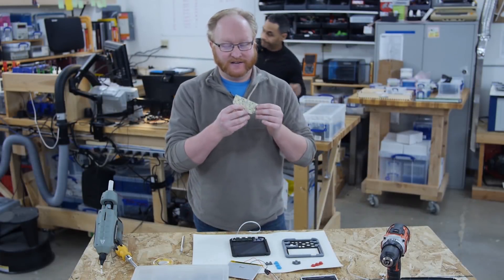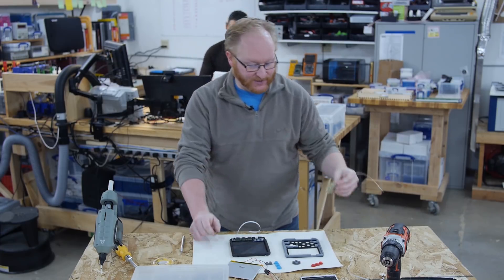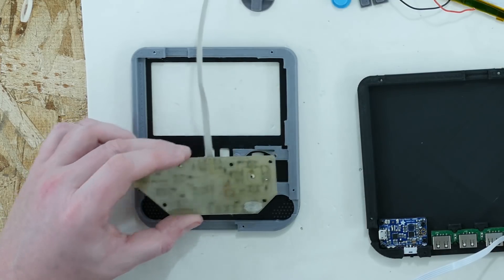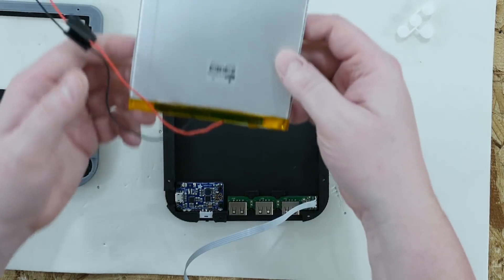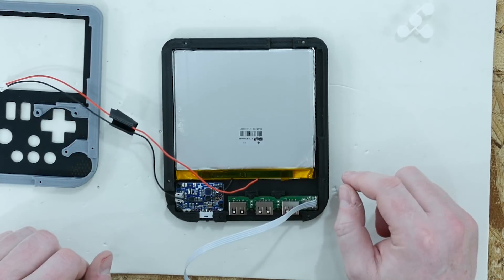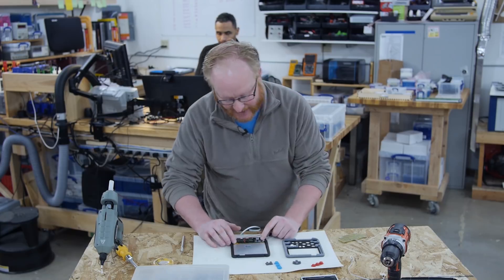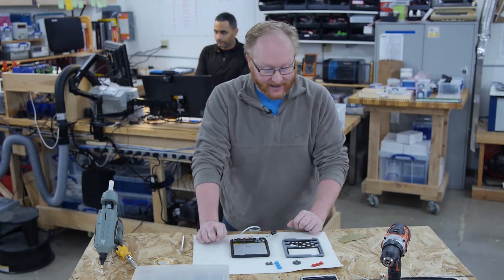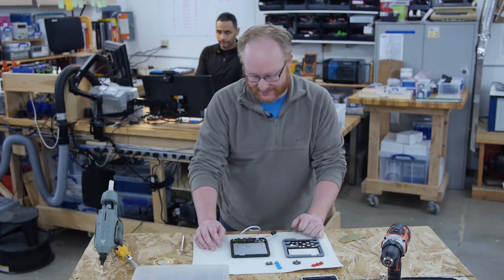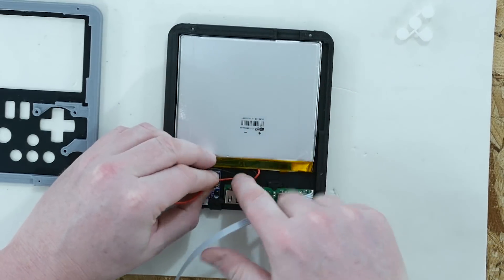Felix removed our test wiring for the keyboard matrix and attached a new piece of thin ribbon cable that we'll rewire once we know the proper distances. The position of this versus the screen is a little different than the test Felix mocked up, but it was pretty close. I removed the plug on the boost converter to save space, but I'm going to bring these wires around and put a two-pin header disconnect so we have a way of cleanly disconnecting the battery without having to desolder it.